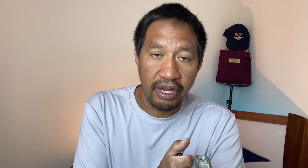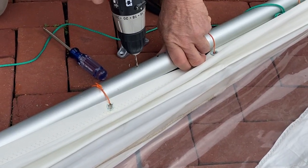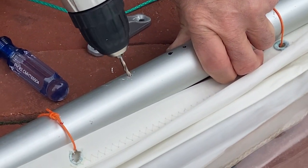Put the outhaul at 64 inches on the starboard side, because that's where most racers put it. Even if you're a recreational sailor, put it on the starboard side just in case you race or sell the boat to a racer — it's not wrong on the port side, but starboard is preferable. The cunningham cleat should be on the bottom of the boom so you can adjust it whether you're on port or starboard tack.